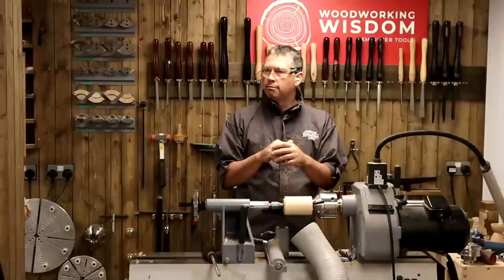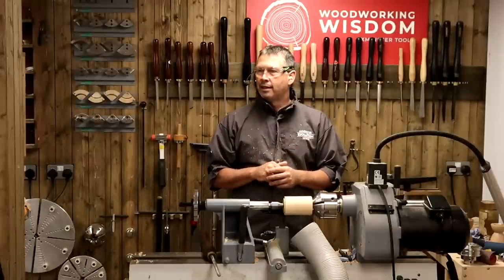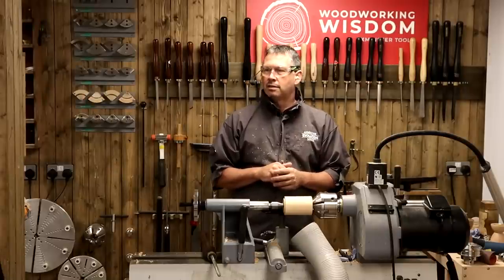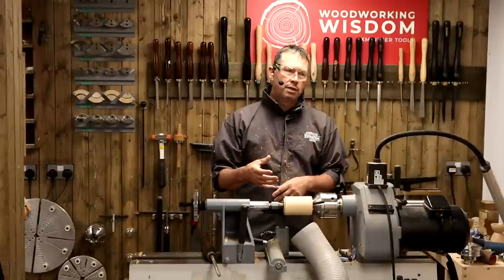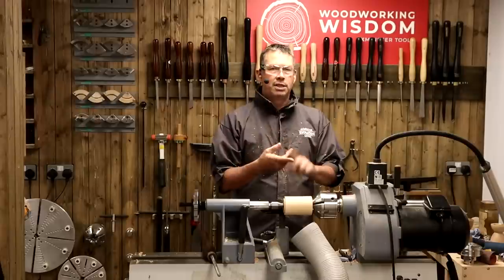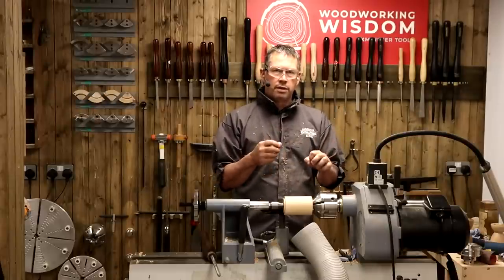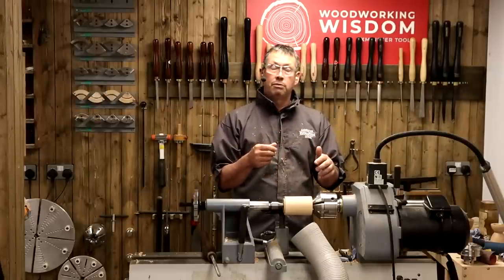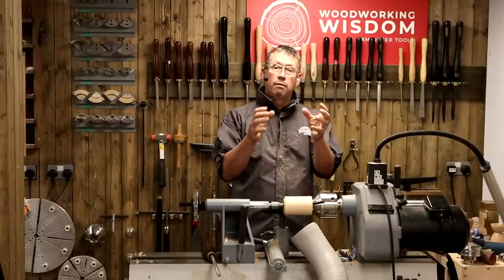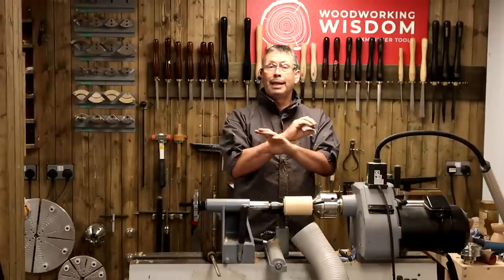So Frederick's asking, do you find that if you use steel wool, it reacts with the wood and leaves small flecks of metal in the wood? Yes, all the time. Especially those timbers with a high concentration of tannin in, oak, chestnut, yew, teak, all of those types of timbers, you will colour the timber. I've just done a couple of demonstrations at SWAT doing that very thing, making wet oak vessels and colouring them with a mixture of wire wool and vinegar, and they go completely black.